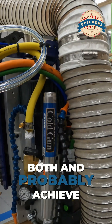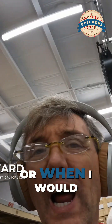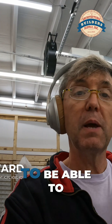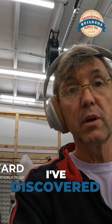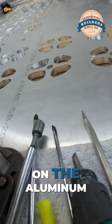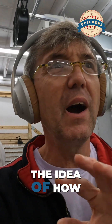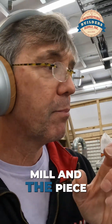I can run them both and probably achieve 25 psi. I don't know why or when I would use two, except I want to be able to hit the end mill itself, but I also want to be able to hit the workpiece, because the end mill can be quite cool, I've discovered. It will be basically room temperature, but when you lay your hand on the aluminum, you can feel that the aluminum itself is warm. So I'm toying with the idea of how to be able to cool both the end mill and the piece that I'm cutting.